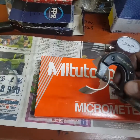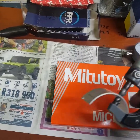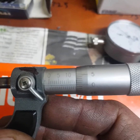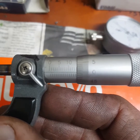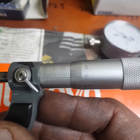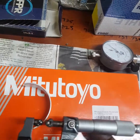So the first thing is to measure the inside of the bearing to give you an interesting reading. This is a 1.5 bearing — as you can see, this micrometer zeroed out on 12.5 — so we are basically sitting at 14 dead. That is a 1.5 bearing on the dot. And now we're going to measure on the side.